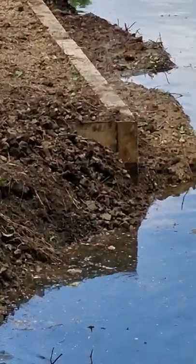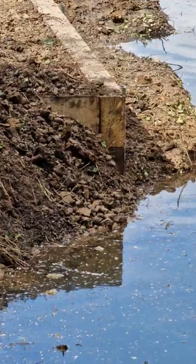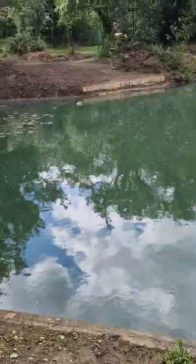But what's underneath there, now I do keep going on about it: full length returns on there, double depth, full length returns, and that's in solid clay. So whilst people will say, oh, it'll undermine, it'll fall apart, it would if there was roots under there and rubble, which there was. Endless rubble, endless angle irons, endless bits of greenhouse. Someone admitted to us, oh yeah, it was where we used to bring all our old crap. Dumped a greenhouse in there. You've got to remove all that stuff first. And if you get back on solid clay, it's sound.